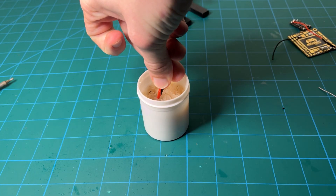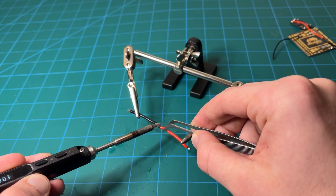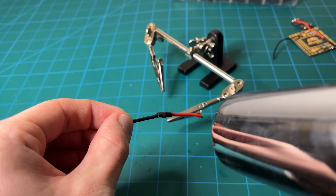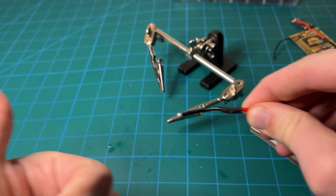Okay, here's how to solder. Strip the wires. Dip the wires in flux. Tin and prep both of the wires. Apply heat and solder to connect the wires. Add on the heat shrink. Use a heat gun to shrink the heat shrink. If that all made sense, you don't need to watch the rest of the video. If it didn't make any sense at all, let's learn how to solder.